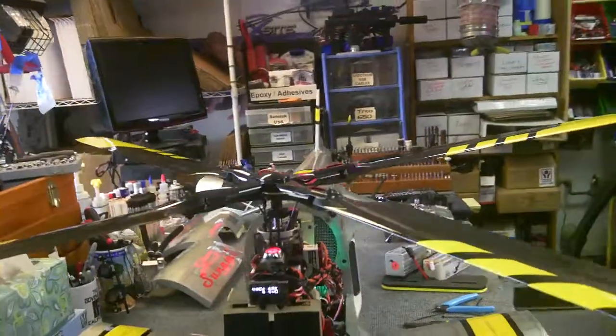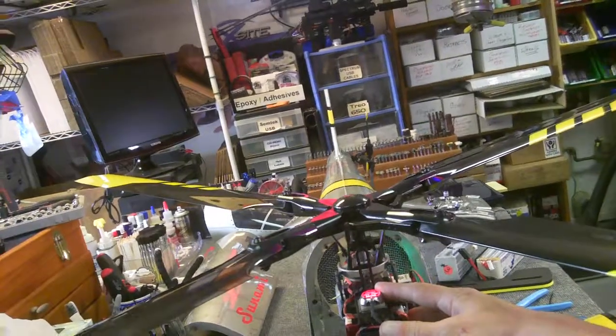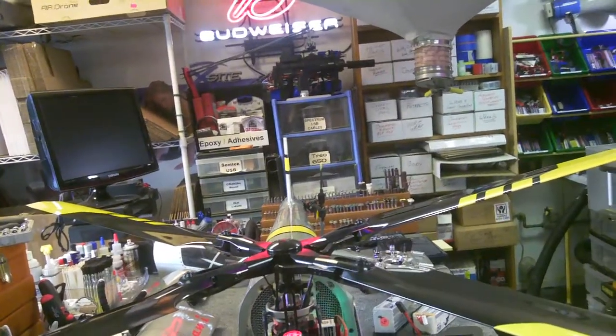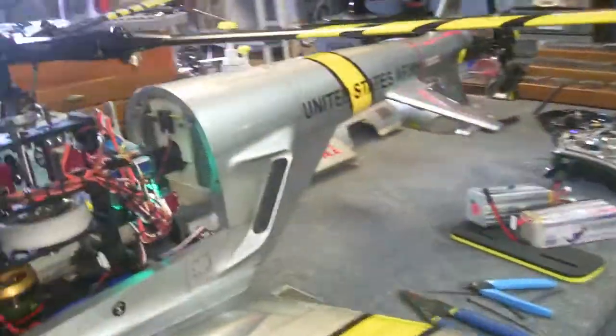What we've done here is upgraded to the new Futaba GY701, which has this really nice OLED display, and it's showing me my regulated voltage to the system bus. The Telecomand has never been known for its tail rudder control, and I've always loved the way Futaba's feel. That's a nice little bonus there.